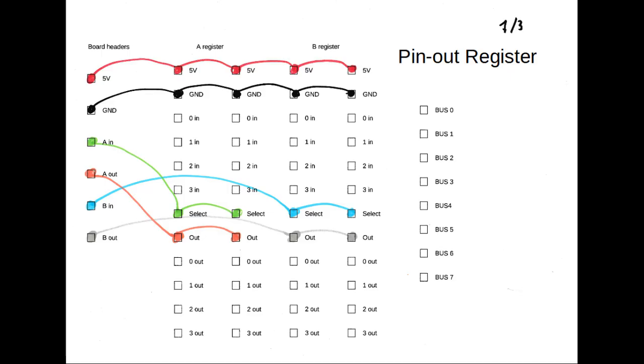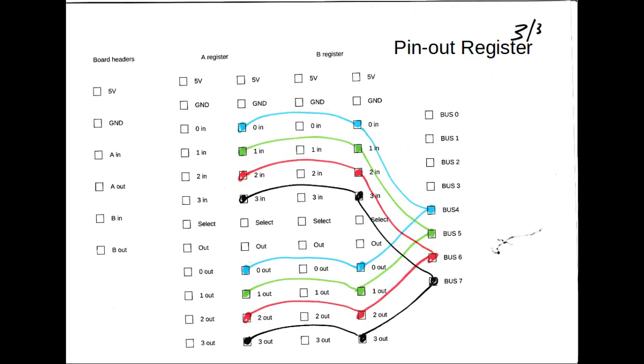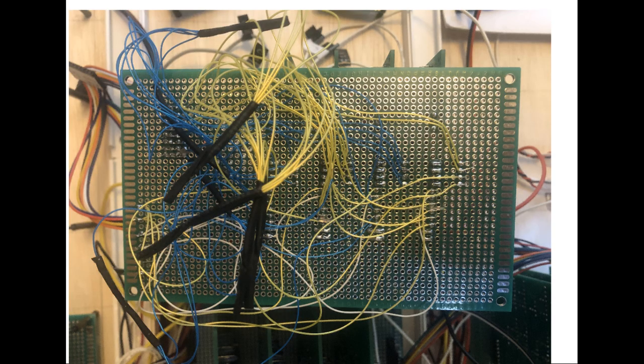If you fix it so that you have 4 of these boards on a base plate, the pins will stick out in the bottom. And here are a couple of slides to see how they connect. As you can see, the ins and the outs of all the 4 boards are connected. This seems a bit strange, but because you have the control electronics, they don't work at the same time, so it's okay to make actually a loop of those ins and outs. I'll show you now the finished work, which is on the board on the right upper corner.